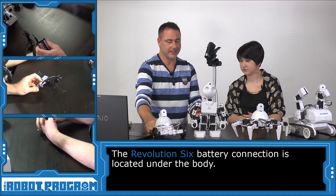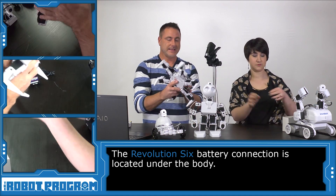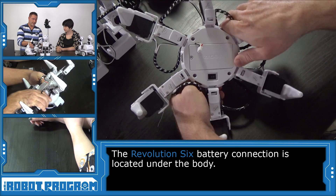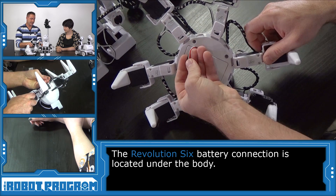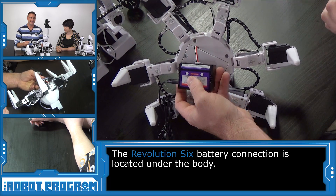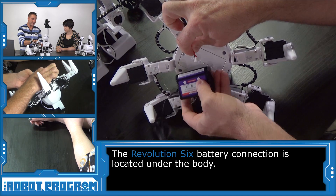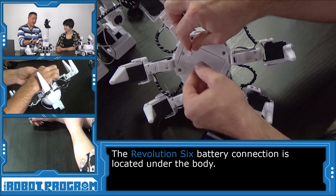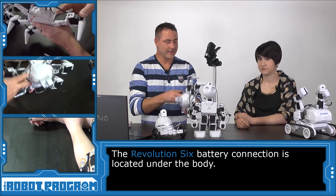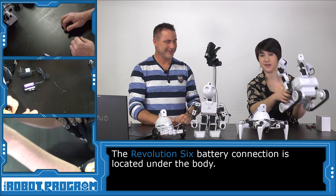Now let's take a look at another robot — Six, the hexapod. You've got lots of legs so we want to make sure we can get in there. Put him down, you'll have the cable popped out, and just reach up, insert it in, and then pull it out. You're not going to pull by the wires to pull it out, because you can pull the wires right out of the plug. Get your finger on the edge of the plug and just gently pull — same reason why you never unplug your laptop by just pulling the cord.